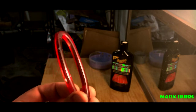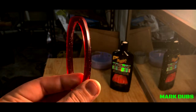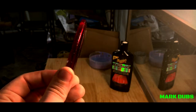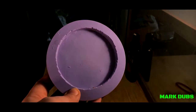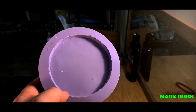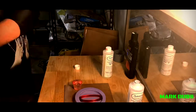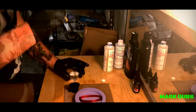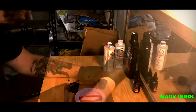Moving on from there, I began wet sanding, which started at 1000 grit sandpaper, followed by 1500 grit, and then finally I stopped at 2000 grit sandpaper. The final step in this process involves polishing the wet sanded parts with a product called Meguiar's Ultimate Compound. And I do have to say, based on the footage and what I saw in person, it is the ultimate compound. This product is primarily used in automotive applications when restoring paint finishes, but I've also seen the same product applied to plastics as well, like headlight restorers. And naturally, I just thought it was a good fit for this type of resin.